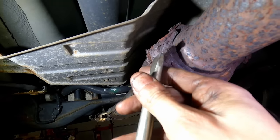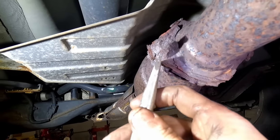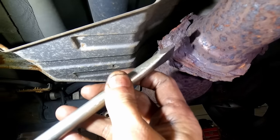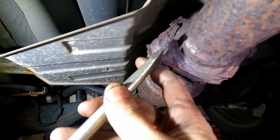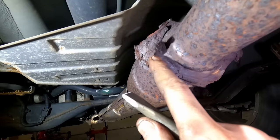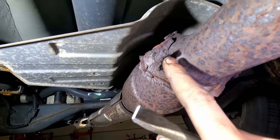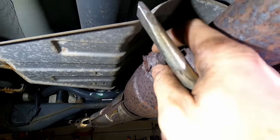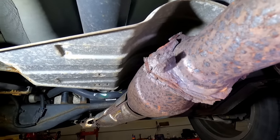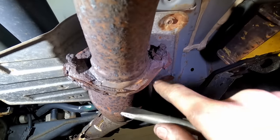We'll start hitting on the nut and carve a nice deep groove into the nut. Once there's a groove carved into the nut — something that the chisel can lock into — we will tip the chisel into the angle of loosening the nut, grab that groove, and start to hit the nut. This is going to do two things: it's going to crack the nut open and split it like a clamshell, and it's also going to get it turning and spinning in the direction of loosening. It'll either open it up 100% so you can slide the nut right off the stud, or it'll loosen it enough that you can just grab it with a pair of pliers and unscrew it. I'll do the one on this side in real time.